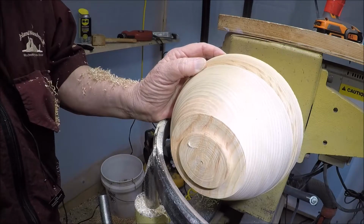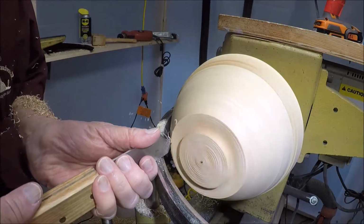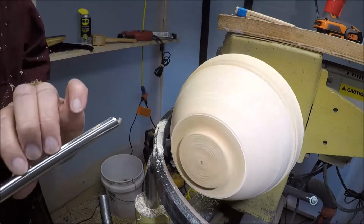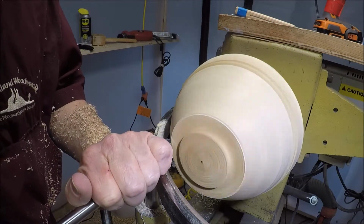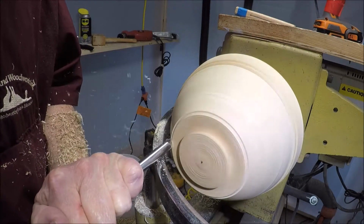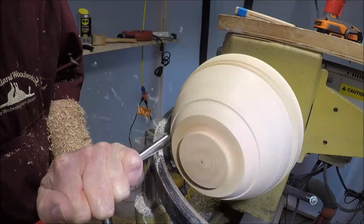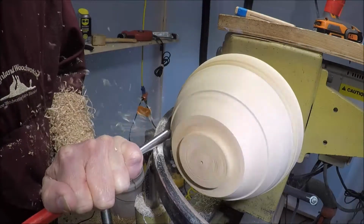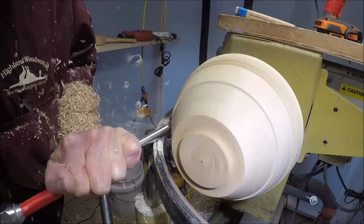Okay, I've got to do another few of those. I'm going to make another little initial cut with this. That seemed to work pretty well. Now, let's go up again. This is a 40-40 gouge, which Harwood advocates in Stuart Batty. Push down on the tool rest, in with the right arm, and ride it up. That's probably between a 32nd and a 16th of an inch of depth of cut, and I absolutely have to keep it shallow. I'm swinging with it as I go.